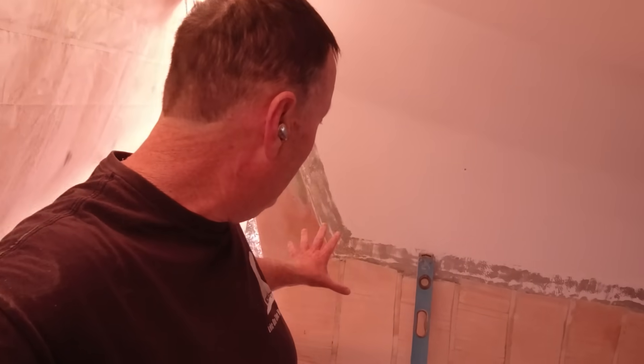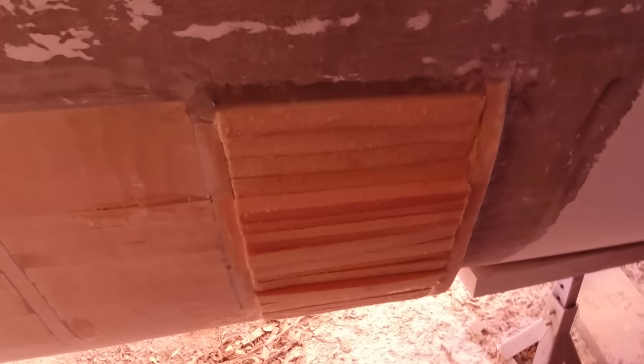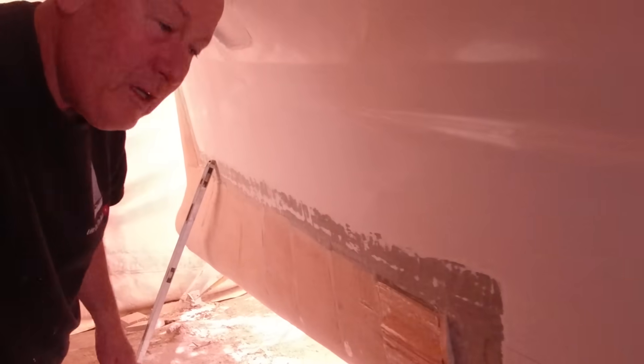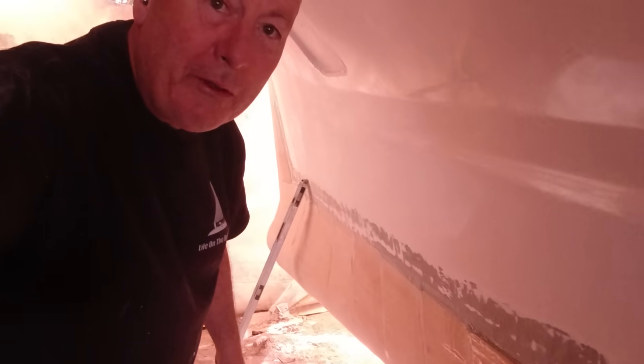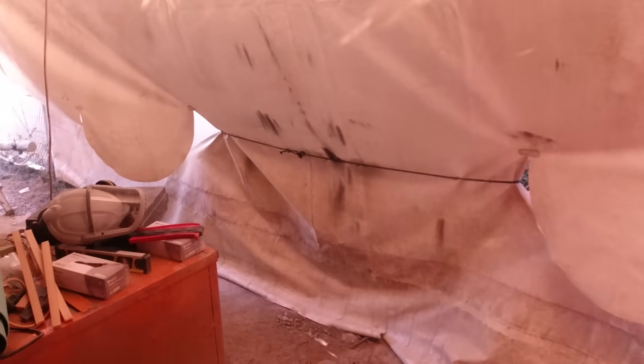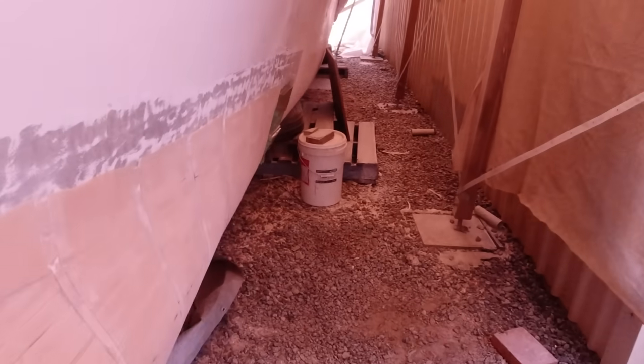Over the last weekend I spent pretty much four or five hours a day on this — it's been 35 degrees every day in here, disgusting — shaping my bows. As you can see here, they're looking pretty good. I've got them almost there with a straight edge all the way along. The only exception is this end one here — this last station is actually going to vanish away to nothing, so I won't need it. That's consistent with the strongback which actually ends about here, so I need to fair this one down almost to nothing — from this edge here down to zero — and that's going to take a little bit more grinding on all sides.